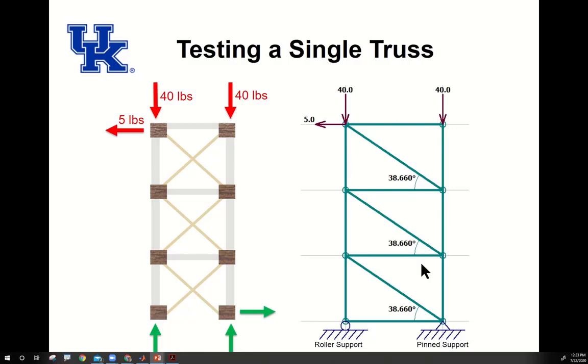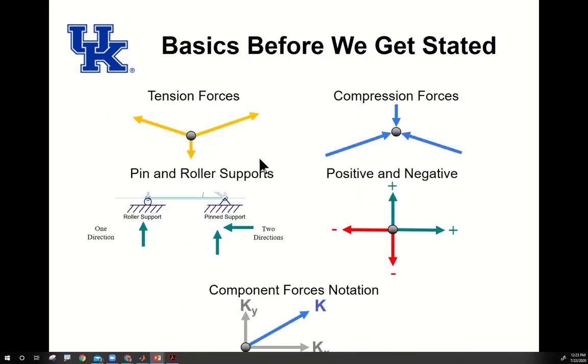If we look at it and we draw it in just a sketch, sort of more as a free body diagram, what happens is we lose these diagonal members that are there because they're really just used for tension and not compression. So in this direction, they don't really do anything with that wind. But wind goes both ways, and so we're going to apply that on top of our tower when we build it. We're going to make some assumptions here.